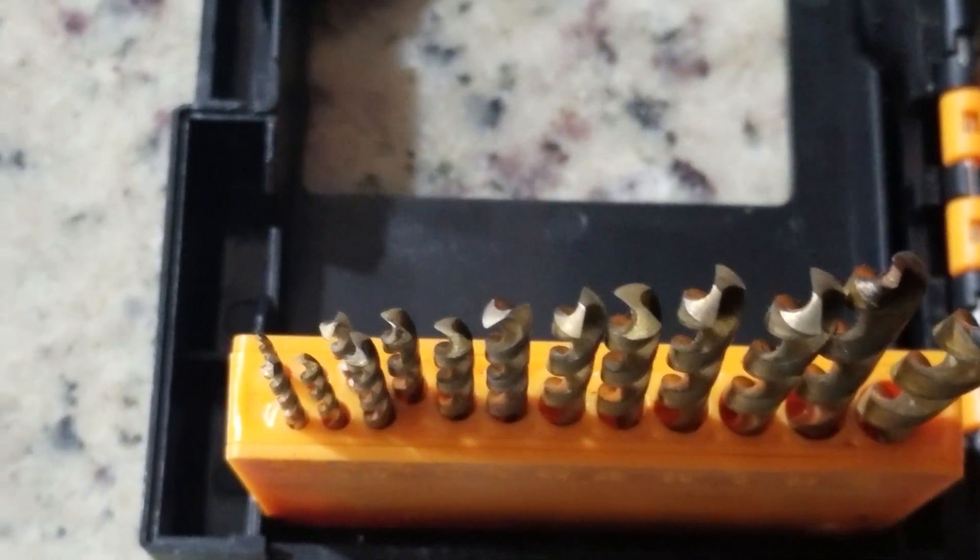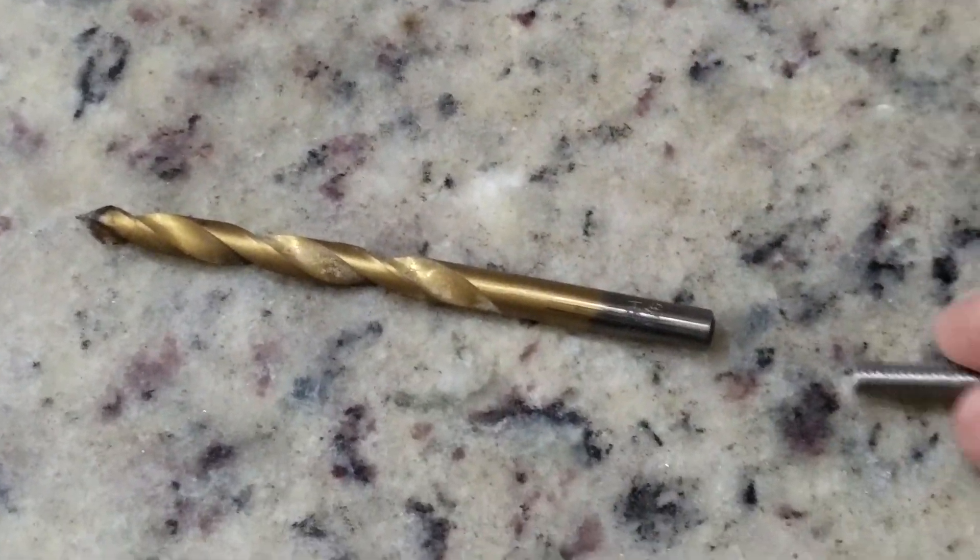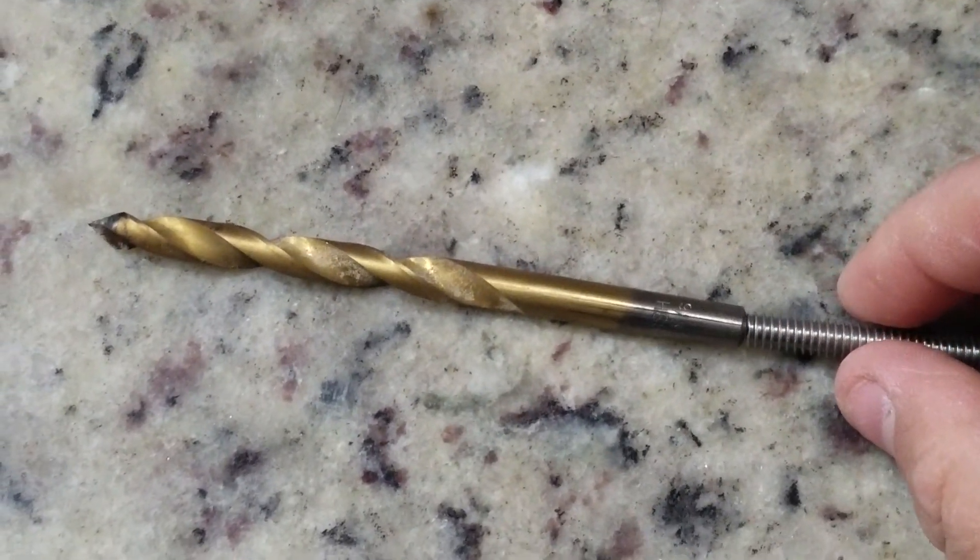This little top piece of wood holds the actual lexan together — you drill four holes into it and mount it with bolts so I can put it in the oven to heat the lexan up. Here I'm just drilling the holes to start building it up. After we drill the holes we bolt the lexan to the wood, slide it into the oven, and just wait for it to get hot.